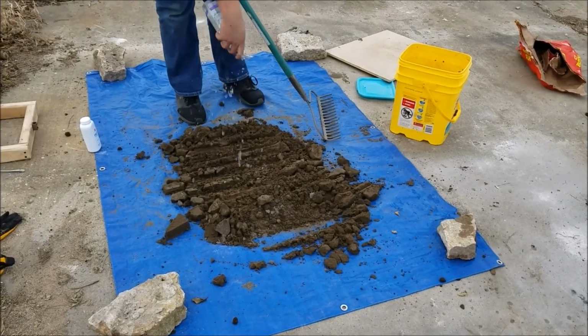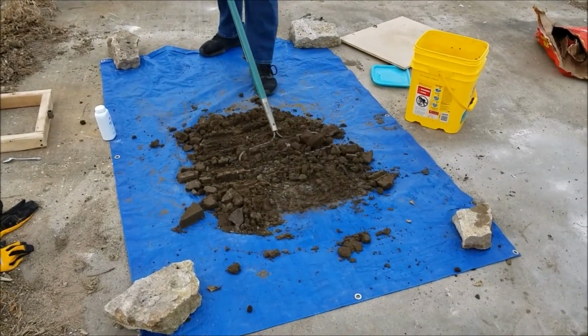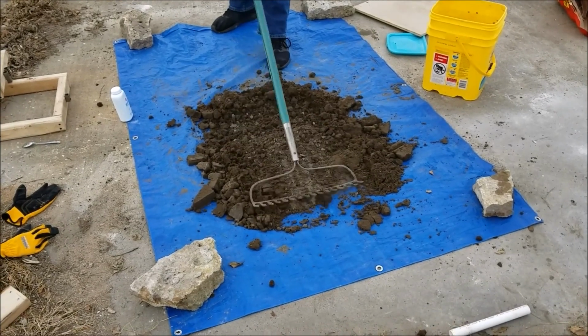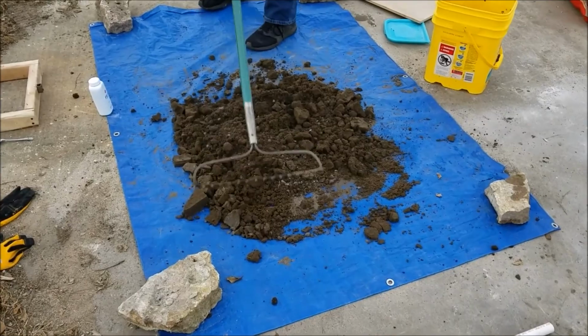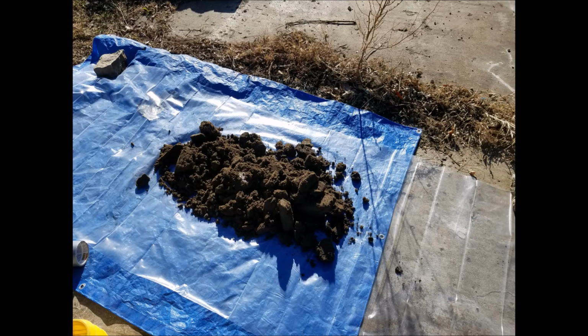It is not actually green, but green in the sense that it is used in a damp state, like in the phrase green wood. The sand is comprised of 100 pounds of play sand, 12 pounds of powdered bentonite clay, and a gallon of water. To the displeasure of my mother, I used a kitchen sifter to sort out only the smallest particles of sand, so that the molds would be more precise.